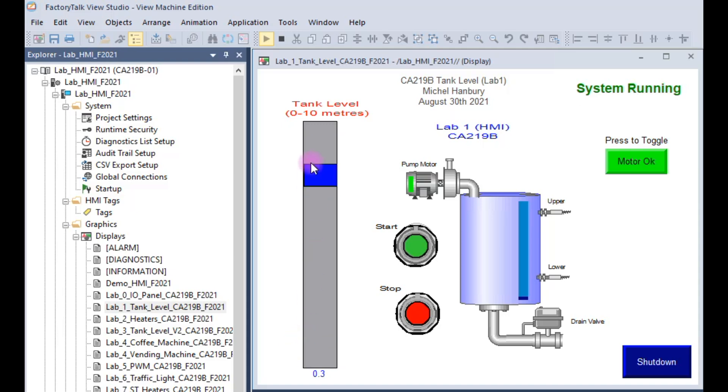The system drains down and turns off at the bottom. You want to make sure your system works that way: when we get to the top it starts draining, when we get to the bottom it fills, and anytime we stop the system it should de-energize the pump and drain valve. When we turn the system back on it remembers where it was — if it was filling it fills, if it was draining it drains.